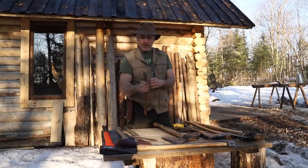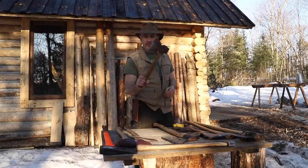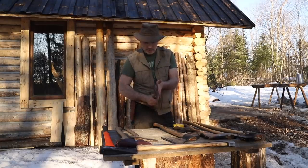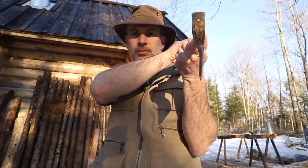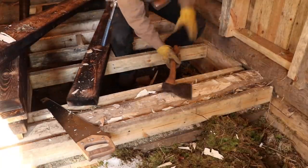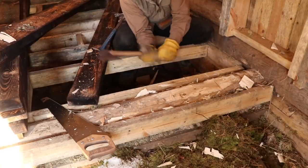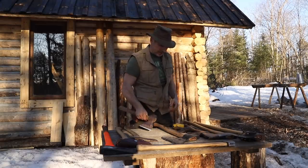When you get into the smaller hewing stuff, these axes were made in Canada — there are thousands of them around still. It's basically a hewing hatchet. This is a right-handed model, flat on one side with the bevel ground only on the other side — same principle. That's for going along the log to flatten it out or take any high spots off. I've got two or three of these things lying around and it comes in quite handy — I've used it quite often on the logs on this cabin to take off branches and high spots.